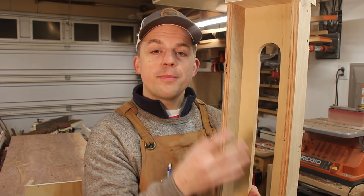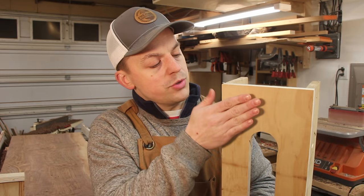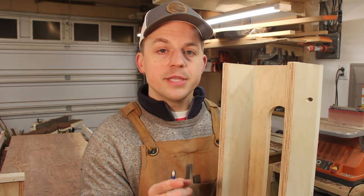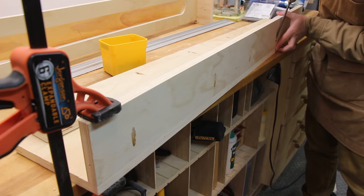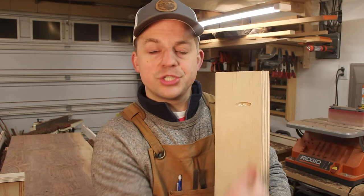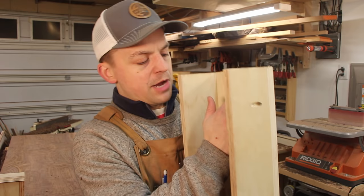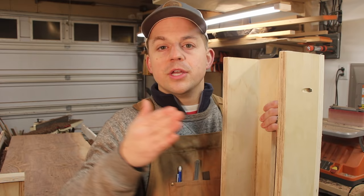Now let me show you a better design. In this design your two indexing surfaces are on either side of the same board — one is where your rails ride, and on the inside is where your router rides. You don't have the same variation in this inside surface because of the way you're attaching the sides to the base: the sides come in using pocket holes. This pulls the bottom indexing surface up tight against your plywood edge, which I'm assuming is cut on a table saw so it'll be nice and square. When I run my hand along it I feel no variation at all — no bumps, no waves. That means I have a nice flat surface that will translate to my slab when I start routing.